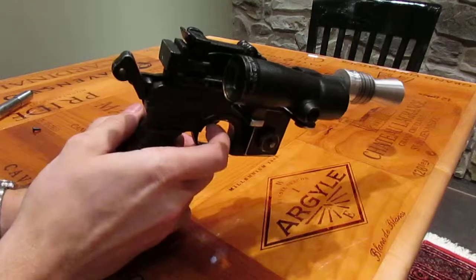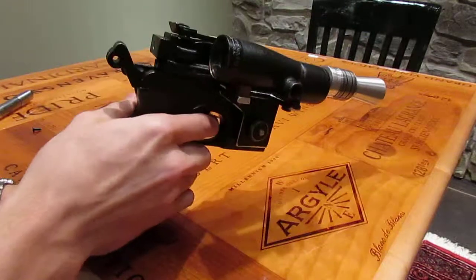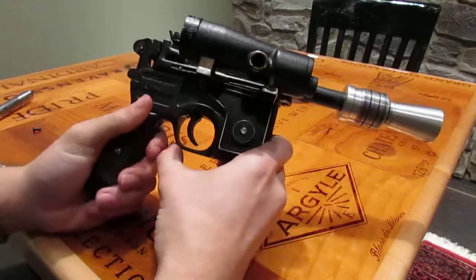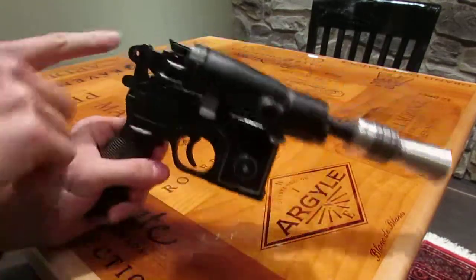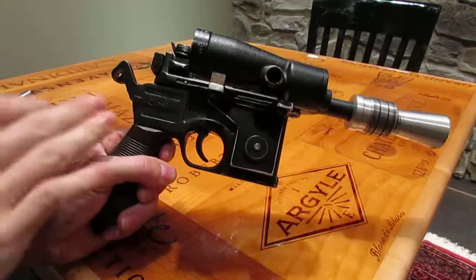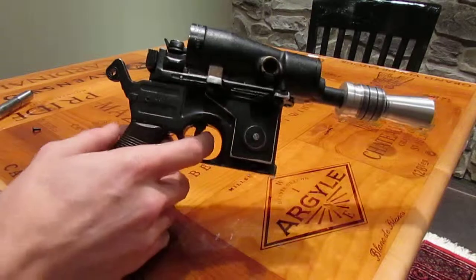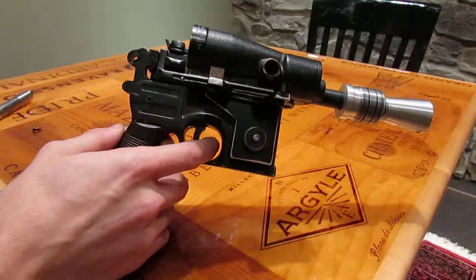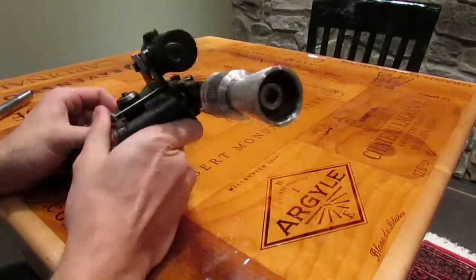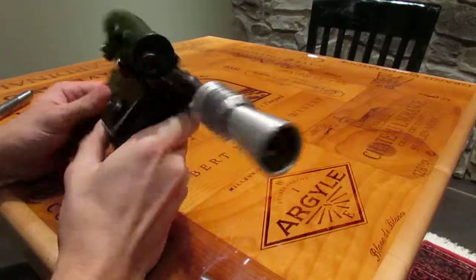And as you could see there, or you could hear, the hammer goes off, and the trigger will not go off before the hammer does. And in fact, you can do that just because it's necessary. When you pull the hammer back, the trigger moves, as you can see. So you have to set up your switch in such a way that pulling the hammer back doesn't activate the board, but pulling the trigger does. So just pull the trigger like you mean it, and you're not going to run into any issues. Let's go ahead and there's the blue.